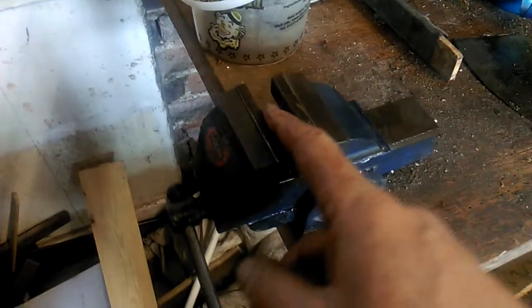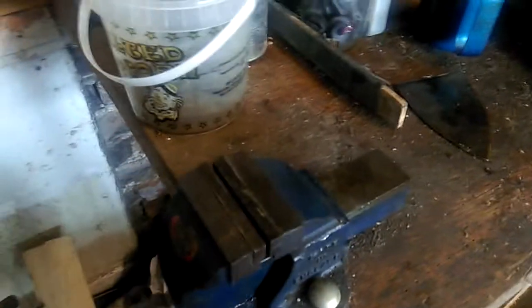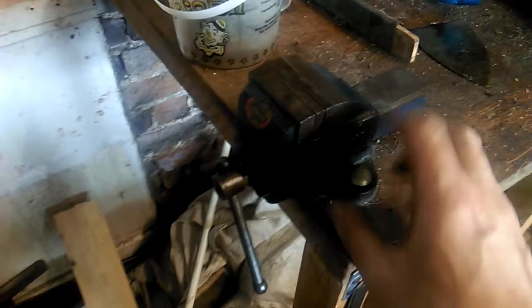This is tiny - a very small vice with tiny little jaws, probably only about two to two and a half inches. A beautiful vice. I've used this if I was making something - if I had a knife and was gluing the handle, I could set the blade in here, put the handle on it, and leave it shut overnight while it set. There's no quick release feature on this particular vice, but it's a beautiful little vice, very compact and very useful.